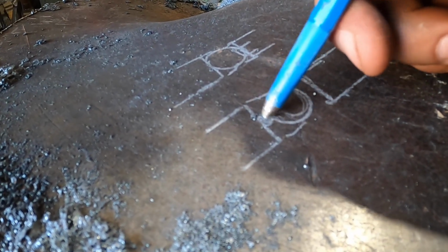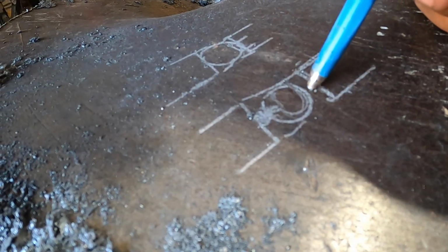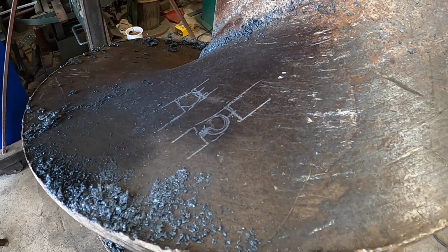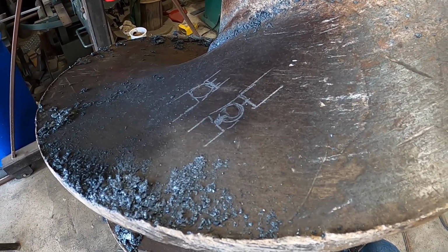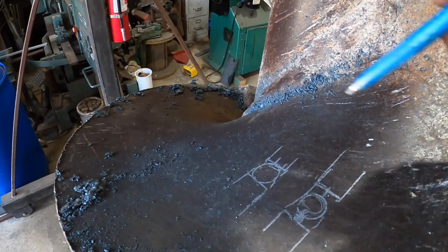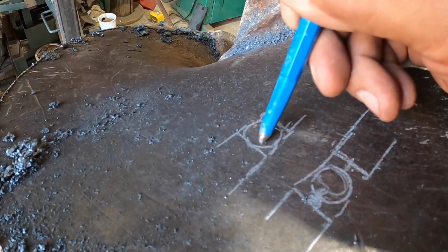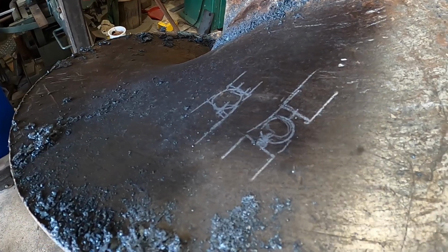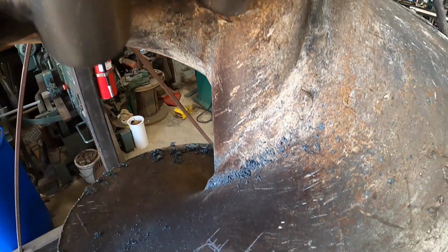I was able to almost have an open root weld, and the same thing with this other side as a filler. So, you know, I've seen people use bolts and pieces of rebar and things of that nature, and when done properly, it could be used as a good fill piece. But like I mentioned here, if it's too tight, then they just get a little bridge, almost like a Band-Aid type of weld, and it just won't hold. So here, fortunately, I was able to fill in that whole area, and it worked out.